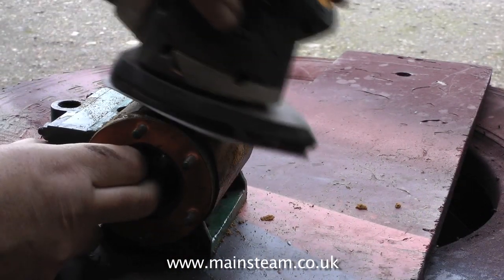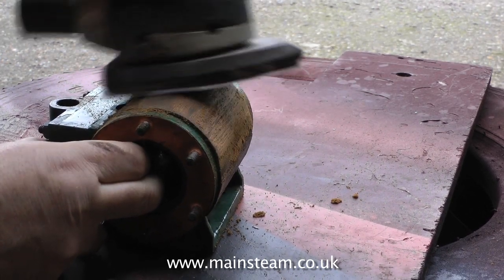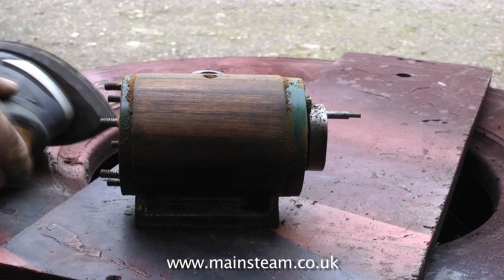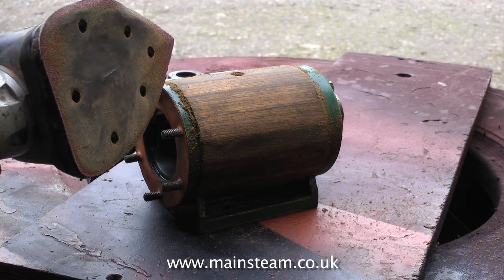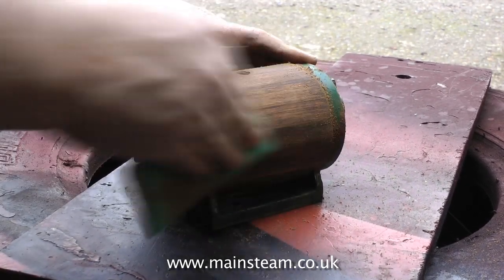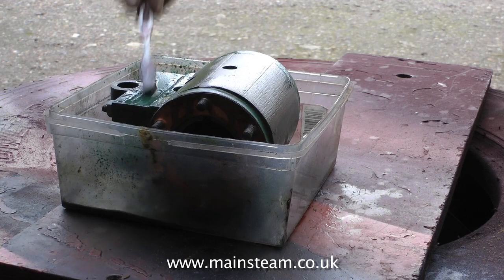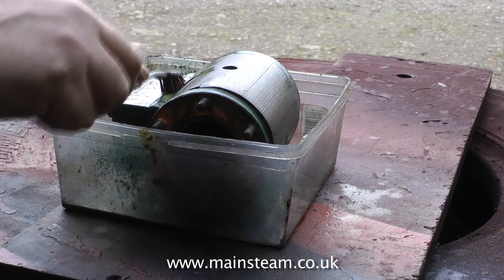When doing a renovation and repair on a vintage engine, I do like to be sympathetic to the state of the thing. But if the parts were badly fitted in the first place, then I have to make sure that it looks good. Here I'm using my orbital sander to clean up the outside of the cladding, but I'm struggling — the cladding is very oil-soaked and it's clogging up the sander. So I'll help it along by hand with some very coarse sandpaper. But the best way is to try and leach some of the oil out with some cellulose thinners — I would be using cellulose thinners to remove the paint anyway. Unfortunately I've nearly run out of this stuff and I need a lot more; I'll get some more next week.